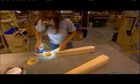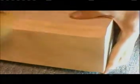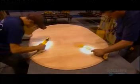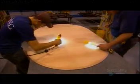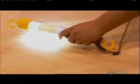Workers closely inspect all the components under fluorescent light. They look for any flaws in the wood that they might have missed during sanding. It's critical that every imperfection be sanded down, otherwise it'll show up as a glaring defect once they stain the wood. After all the parts pass inspection, assembly can begin.